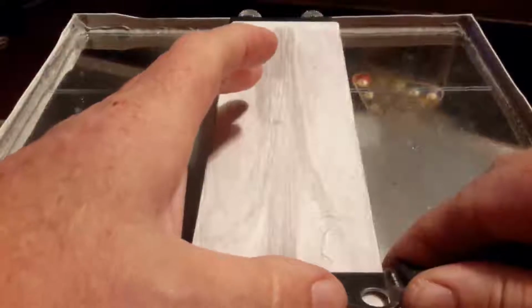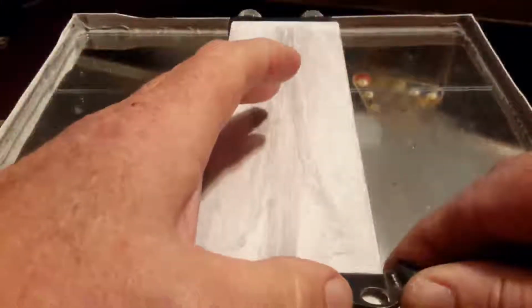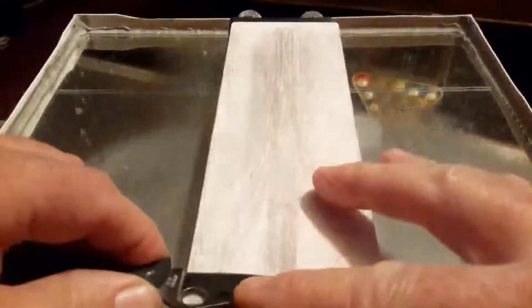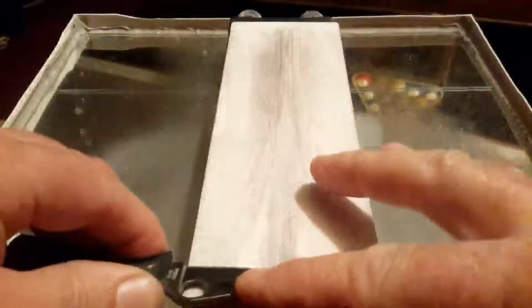That will make it feel very sharp. But that steel, since it's folded up once, creating a burr, and you fold it back out straight, it's very weak, and it will snap off when you start cutting. Your blade will get dull faster, and you'll think that particular blade steel doesn't have good edge retention. And sometimes we buy a knife for the only reason that you want good edge retention. You want it to stay sharp for a long time.